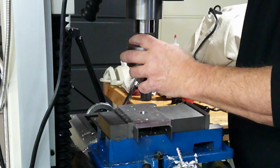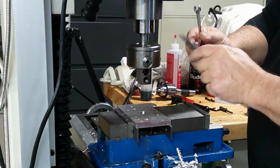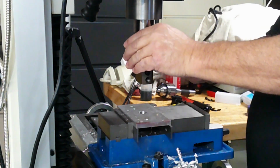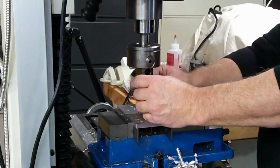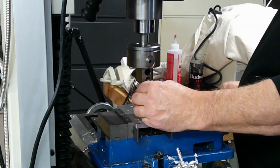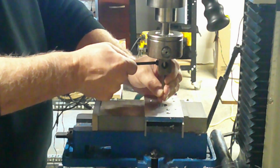Because of the limitations on the tooling design imposed by the fact that the workpiece mostly surrounds the tool, boring is inherently somewhat more challenging than turning, in terms of decreased tool holding rigidity, increased clearance angle requirements, and difficulty of inspection of the resulting surface. These are the reasons why boring is viewed as an area of machining practice in its own right.